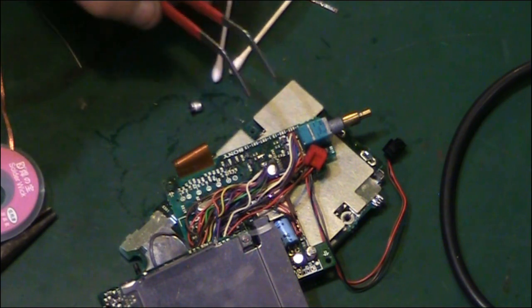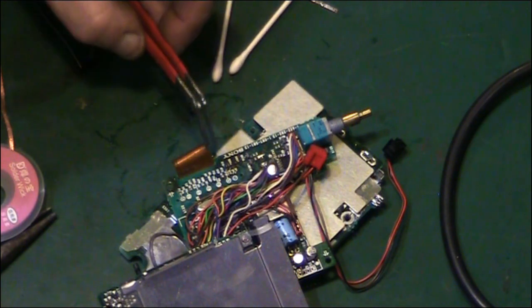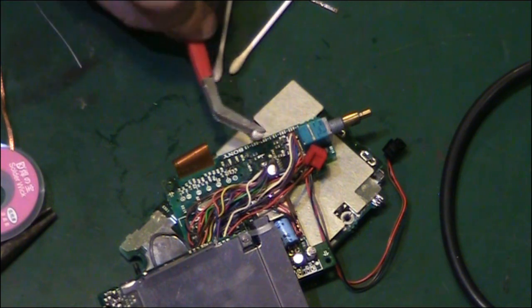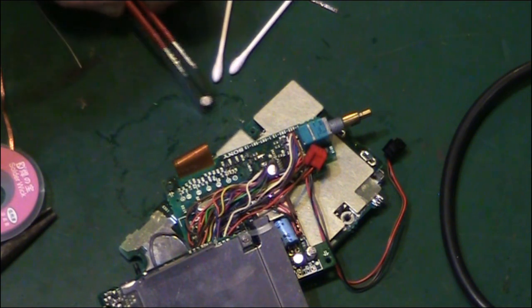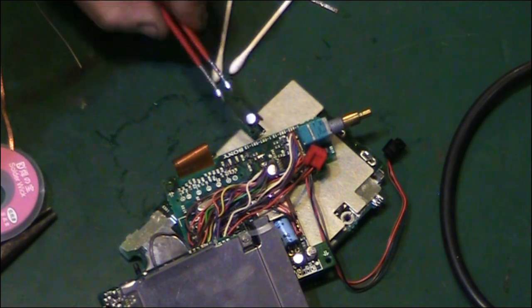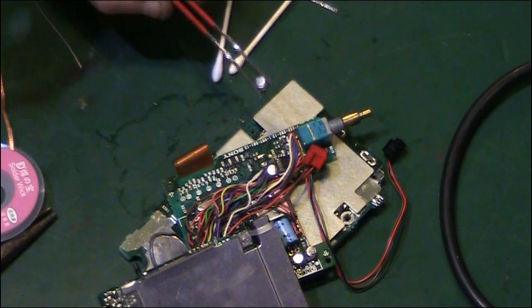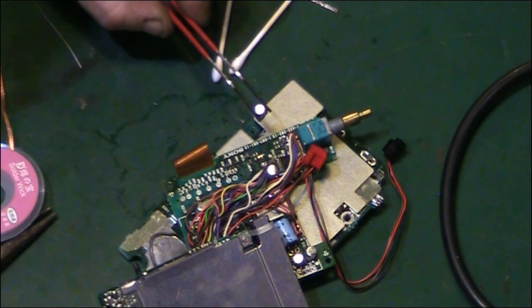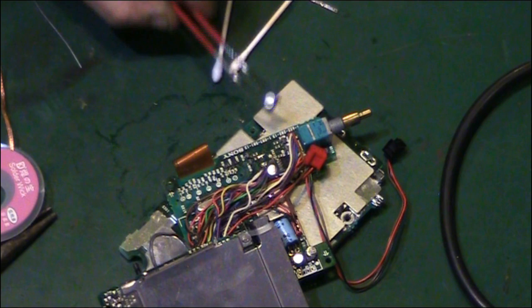damage. It's nasty. It is one of the problems with these capacitors, these early surface mount electrolytic capacitors, that they weren't stable over the years. Like I said, it's not just things like Sony products, it's Commodore Amiga 600s, Commodore Amiga 1200s, Mac Classics. I've even seen camcorders and things like that from the era, and they all suffer the same problem, and it's all with these capacitors.